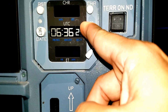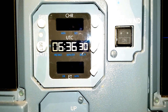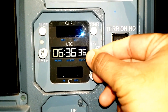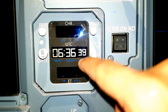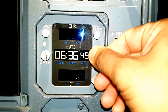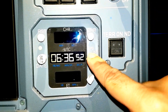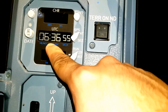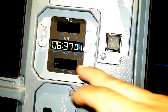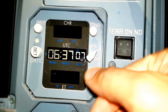When we take this to the GPS position, the clock also gets input from the GPS data. Whatever GPS time in UTC, the clock will be receiving that data and showing you the GPS timing. We can see both timings - GPS and the internal clock timing - and normally they will be synchronized. The SET position is for setting the timing if we replace the clock or battery and the internal time goes off, so we have to set it to UTC.